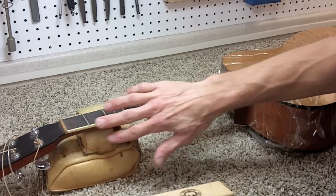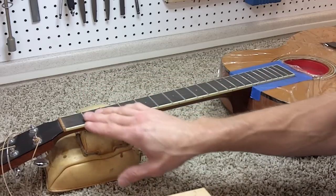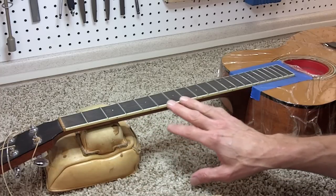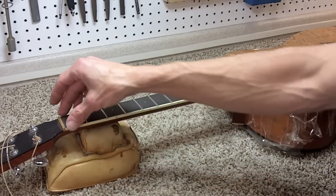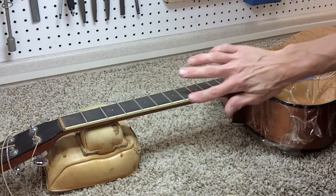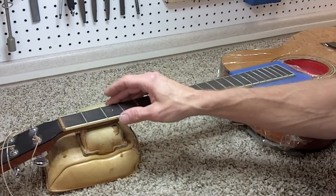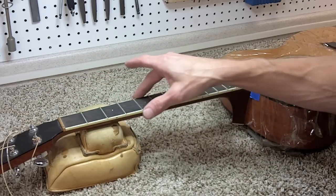The only time you don't want to do this, or want to be very careful, is if you've got a maple neck — say a Tele-style neck that's painted. In that case you can only do the fret ends and have to accept whatever angle the fingerboard is beveled at. But in this case, it's completely okay to take that angle down into the side of the fingerboard. It's personal preference — you can make a bigger or smaller flat — but it makes for a pretty comfortable neck if you have a slight bevel there rather than a sharp edge.